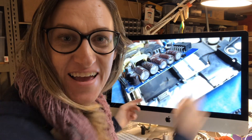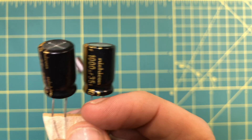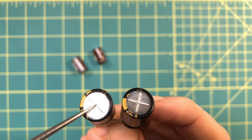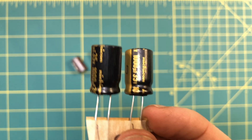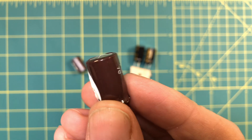I got down to the power supply and those are some really swollen capacitors. Let me take you in for a closer look. These are brand new electrolytic capacitors and you can see that they have nice perfectly flat tops. The score lines are here to allow it to fail safely, because electrolytic capacitors age over time. Here on the capacitor out of the power supply, its top is starting to bulge.